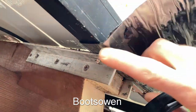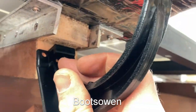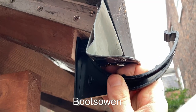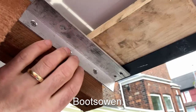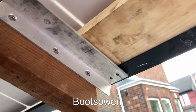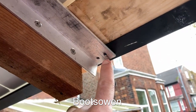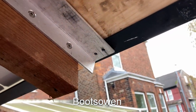And so that's the flashing in there, wrapped up around two or three screws. And then this bracket will go on here. There should be enough to get a purchase on there. It should work like that. So I screw in these three screws and then I drill a pilot hole here because I've got a self-tapping screw like this, but it needs a hole to go into.